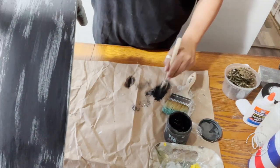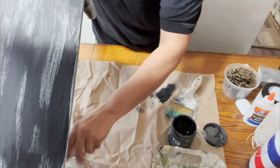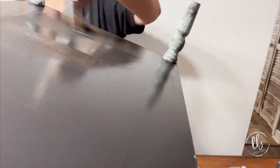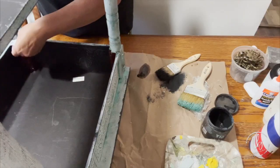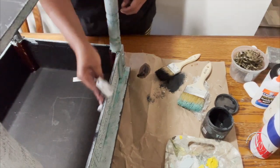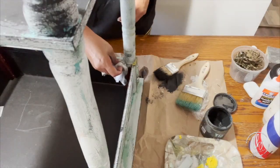Because legs are very well used, I applied a little bit more black on the bottom of the legs. I also painted the underside of that bottom shelf because thin boards can buckle if they're not painted underneath. Then I cleaned up all the inside where I over-painted, just with a wipe.